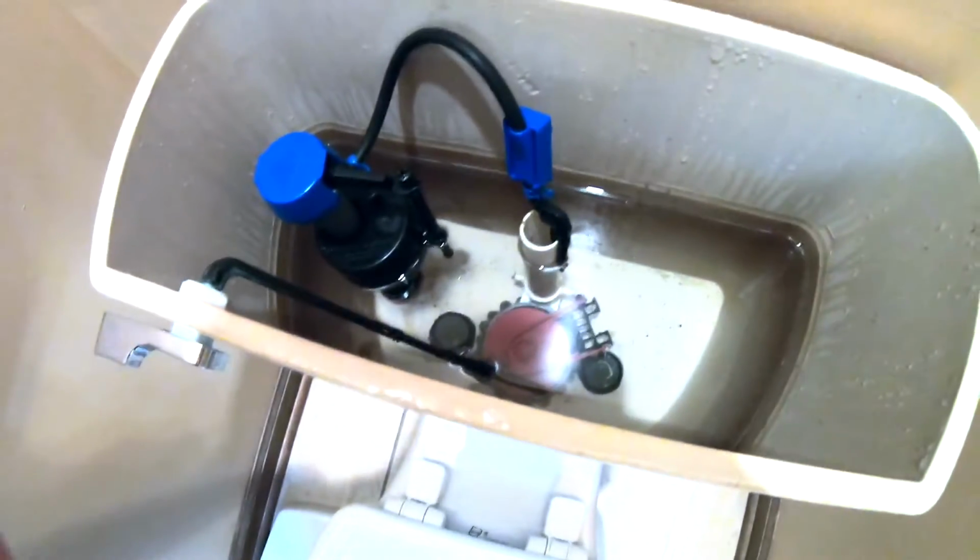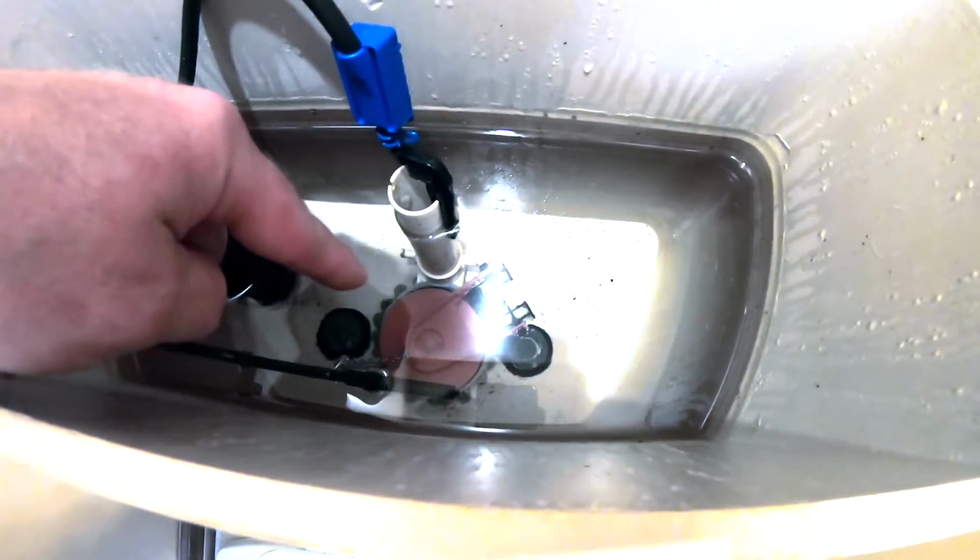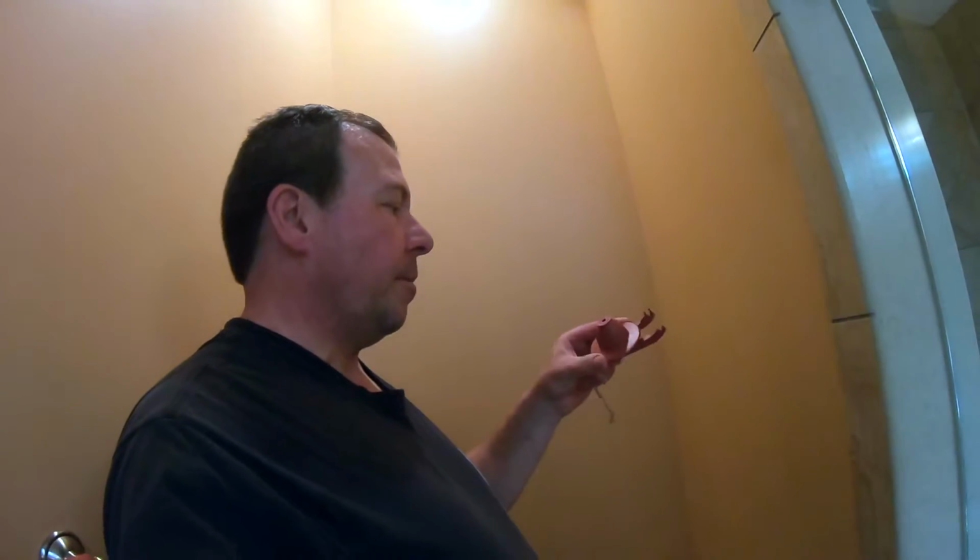There's really only so many parts to a toilet, and as I said, I've fixed 3 of them, so that only leaves 1, which is what we're going to work on today. As you look down in here, if you've got a leak, the easiest thing to do is replace that flapper. Over time, the flapper can wear out, and so you just go to the hardware store and pick up a new one of these and replace it. And we've got a video about how to do that. It's super easy. But start with that, because if that's your problem, these are just a few dollars and the job just takes a minute or 2.